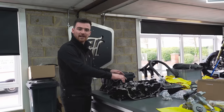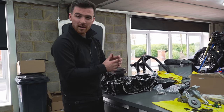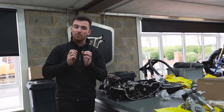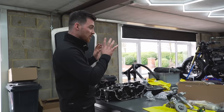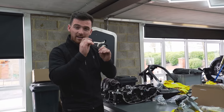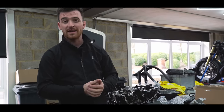Taking the crankshaft out doesn't need much disassembly, so I'm going to take the gearbox out now, take it all the way apart, and take it to give it a super finish. Super finish is basically going to put it in the tumbler to strengthen up these parts so we don't give any chance for cracks or stress fractures to form. We'll head over there once it's all apart.